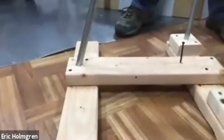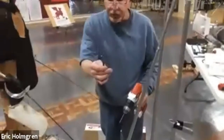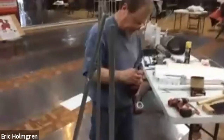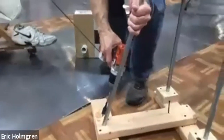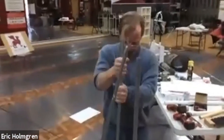I held it temporarily in place to see what the angle is, then pre-drilled a hole at the right angle to act as a guide for the auger bit — which has a pointy thing in the middle. Once you've pre-drilled the pilot hole, you put the auger bit in the drill, line it up, and it will mostly follow that pilot hole. You can judge the angle as you're drilling and match it — close will count.